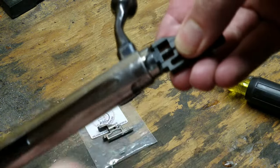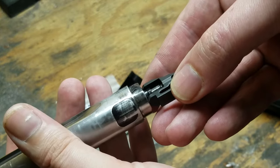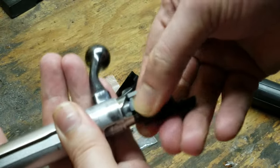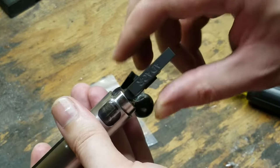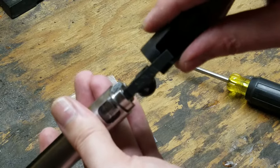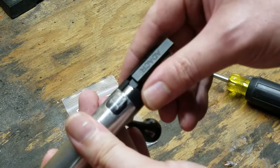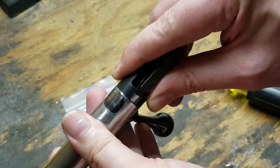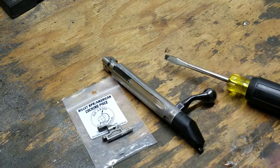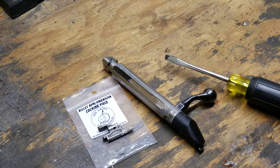At this point, if your cocking piece and firing pin aren't quite lined up true, make sure and twist them and pinch them until they're nice and lined up together — otherwise the bolt shroud won't go back on. Then twist the bolt shroud and cocking piece counterclockwise until it clicks. And that's it — the Ruger American and Predator bolt disassembly. If this video helped you out, hit a like and share it with your friends if they've got this rifle. Thanks for watching.